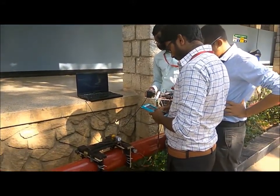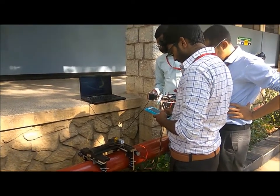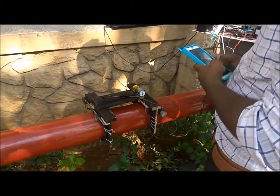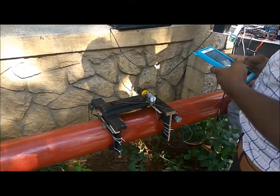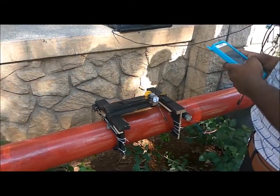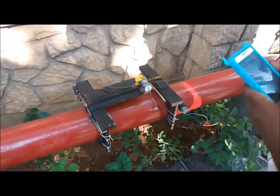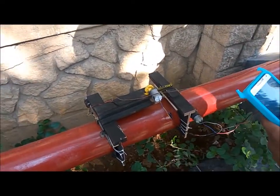In the video you can see wire strings which hold the gripping clamps to the tire part. This is done in order to improve the holding efficiency of the robot. Codes are given in this way by which the whole operation is done. The motion is similar to that of inchworm motion. The pipe compatible with the diameter of the holding clamps is selected, and the suitable model is selected and implemented with the pipe.